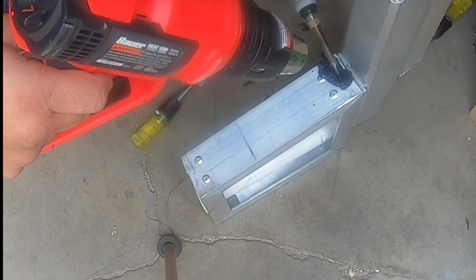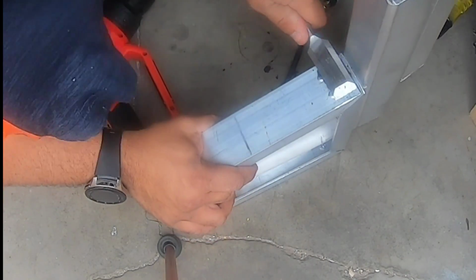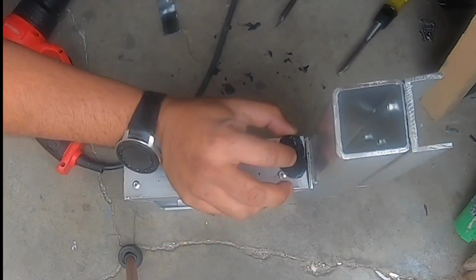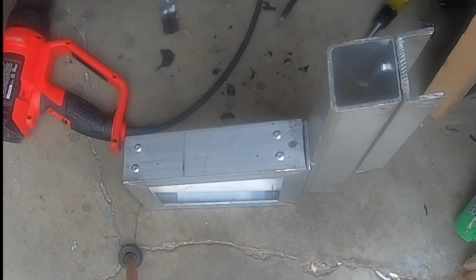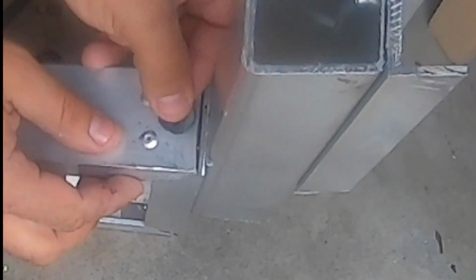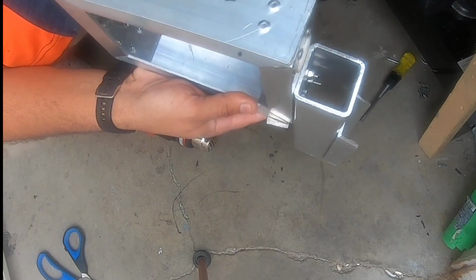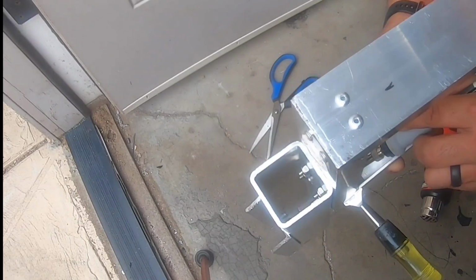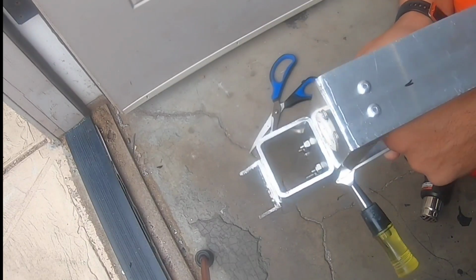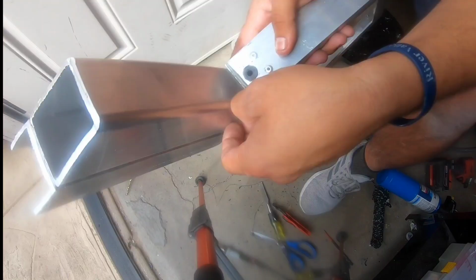Next, I had to flange the entry points and the exit points for the rope so it wouldn't fray the aluminum. And that actually kind of sucked. Now, looking back at it, I probably could have just honed and polished out the port, and I think that would have been fine. But I was obsessed with making this sort of flange fitting. I did it out of HDPE because it's naturally kind of self-lubricating. It's very hard for anything to stick to it, because the more dense a plastic is, the more smooth and slick the surface. So I cut pieces of a tote, melted it down with a torch and then a heat gun, and I fabricated and molded that in.